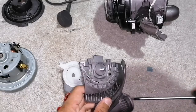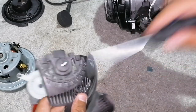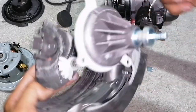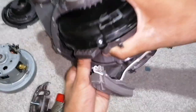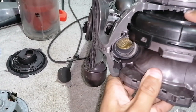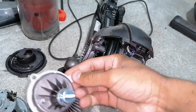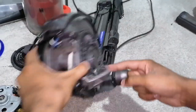Now this is the part that a lot of people struggle with. This cog here — you need to loosen it, just a few turns with the screwdriver to loosen it. Then what you do is you can put it on, because what you're trying to aim for is this first tooth over here mates up with the first hole in there on the far left. So you stretch this out again, making sure these three holes here match up with these holes as well for the screws.